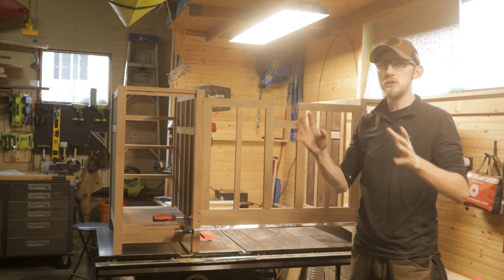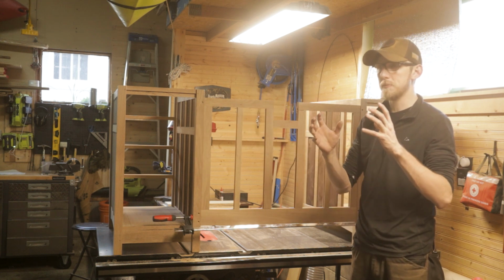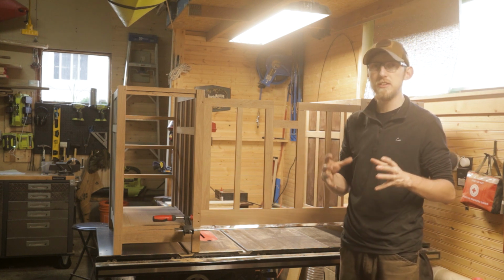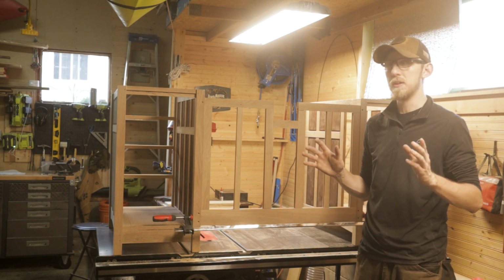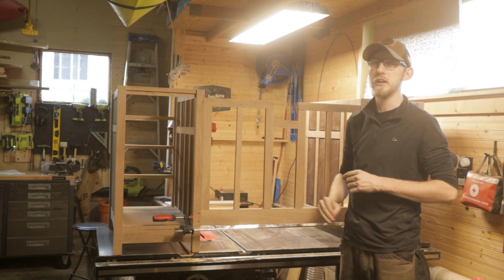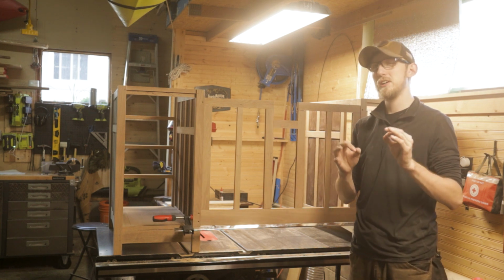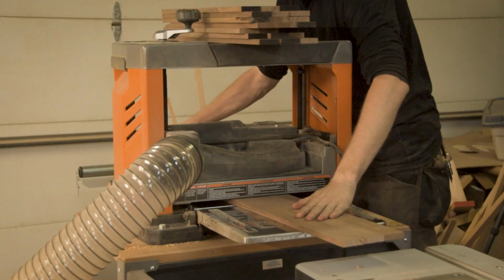And so I'm going to be trying something a little bit new with this panel and the two other smaller back panels. I'm going to glue them all up with the walnut panels in them. And then once we have them all glued together, we're then going to pass them through the drum sander a few times to actually get everything nicely flattened out. This is something that I really wish I'd done with the side panels over here, because that gets everything to a nice equal depth. But the only thing I'm concerned about here is I'm not quite sure how you finish the inside areas here.